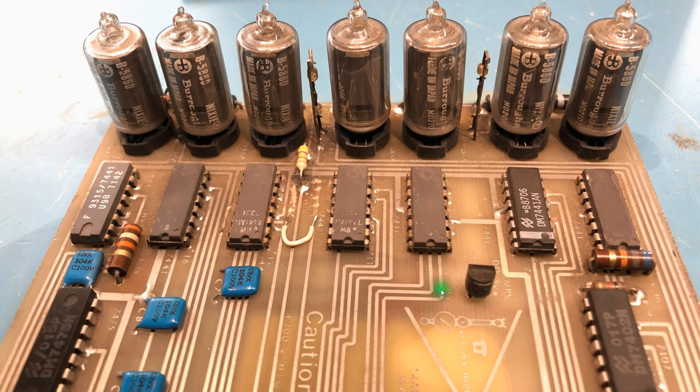There's a transistor here associated with the high voltage — that's my guess for what 'HV' means here. It looks to me like the high voltage comes up through the resistor and routes over here, and there seems to have been a trace that ran around there. When the original resistor melted down, it took the trace out, so somebody removed the copper from the board and put in a jumper link — not a bad little fix for what it is.